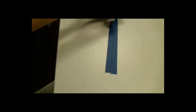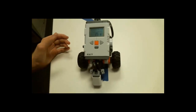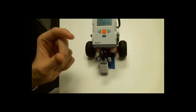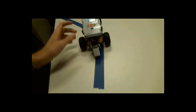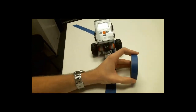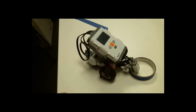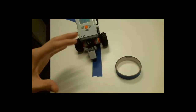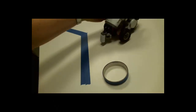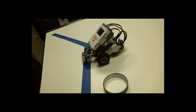The issue with line tracing is that it has a chance of coming off the line at different angles. Maybe this time it'll stop like this, the next time it'll stop like that. And it can be very slight, but in competition a slight change in angle can mean a huge difference if you're trying to do something accurately. So line tracing is really good for if you have some sort of objective that's next to the line that you have to bump over — that doesn't require a lot of accuracy. That's when line tracing is useful. Otherwise, I would only use line tracing to get to a general area on the map. Otherwise, I would use the driving-until-you-hit-the-line method to stop your robot, because that can be more accurate for more complicated challenges.